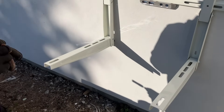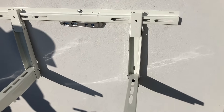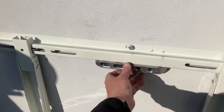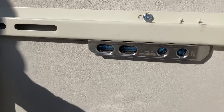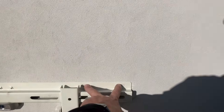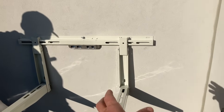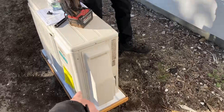The center of our feet is 22 and a half inches, so we're going to set our brackets at 22 and a half inches. Once we're dead level, we're going to secure a couple bolts on this side and one on that side. I want to concentrate more bolts on the right-hand side because that's where the majority of the weight is — that's where the inverter is.